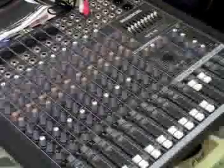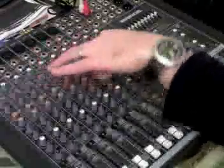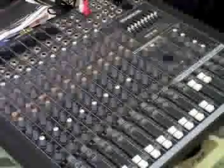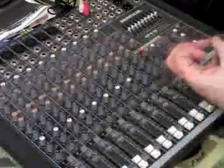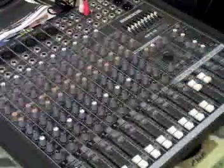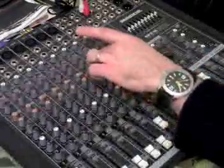And why you would want to use those typically, again, and there are exceptions to these rules if you like, but another rule of thumb, typically you would use these for external effects. So you might want to send the signal for the channel strip out to some kind of effects unit, a chorus, delay, I don't know, reverb unit, whatever it might be. And you want the signal and the amount of reverb and everything else that the signal is affected by the outboard effects processor to be adjusted in proportion to the level of the signal on the channel strip. So you would want that post fader.